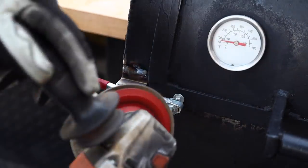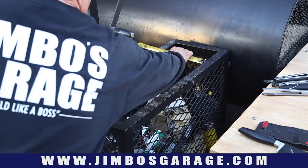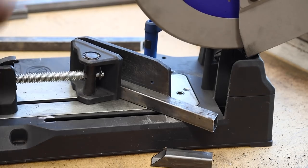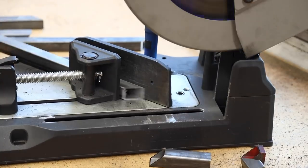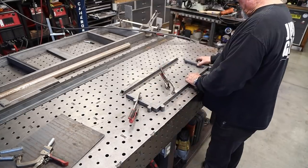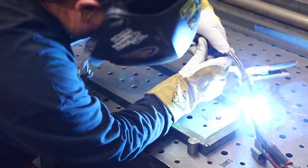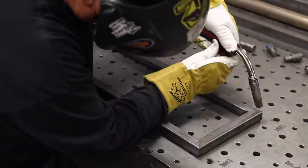Now it's time for the utility box lid. I had some diamond plate on the side of the shop and used the plasma cutter to cut it to the right size. There's a little bit of a warp to it, so I've got some one-inch square tube to make a rectangular frame just a little bit smaller than the opening on the inside. This serves two purposes: keeping the lid centered and straightening out the plate. I fastened it down on the welding table with table dogs, clamped the pieces at 90 degrees, and welded as much as I could with everything clamped.